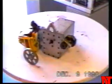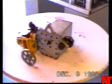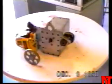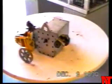These are the components of the APU, or auxiliary power unit, consisting of a square aluminum oil tank which houses the lubricating and cooling oil. Mounted inside is a CBX Honda motorcycle oil pump and 2 Detroit diesel fuel pumps, also powered by the same tooth belt. Power is provided by a Mac 140 McCulloch chainsaw engine, specially modified to mount separately without any chain on it. It's the belt drive from the clutch.